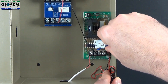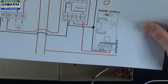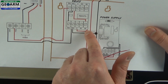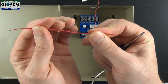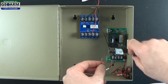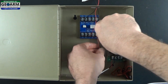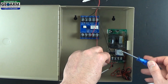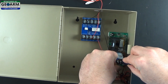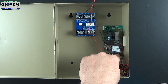You'll also see the backup battery leads coming from the power supply — we won't have to worry about that until the end. The next step is to take our red wire and run it from DC output positive into the trigger positive NO. Both edges of these wires you want the least amount of copper exposed, and just enough distance for them to reach each other. I'll go ahead and start from the relay first — screw it down into the NO terminal. Then the other edge will go into the DC output positive. So you have NO going to DC positive.